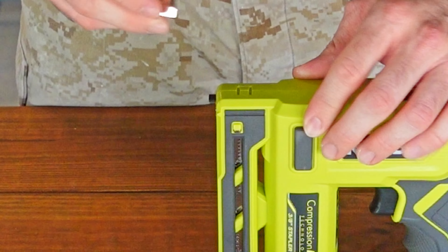Moving on to the particle board — a little bit of difference here, but again it's very minimal from what you can tell. You've got the minimum setting here, then maximum. Maximum almost is flush; the minimum, not quite so much — I would definitely come back and use a hammer on this. But they're really similar, so again I'm kind of disappointed that there wasn't a bigger difference here. It's either just that powerful or there's really not that big of a difference between the two settings.